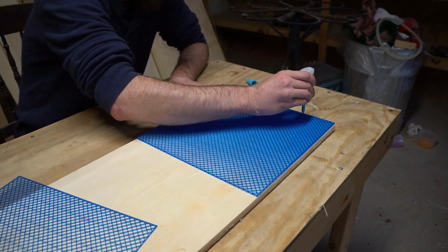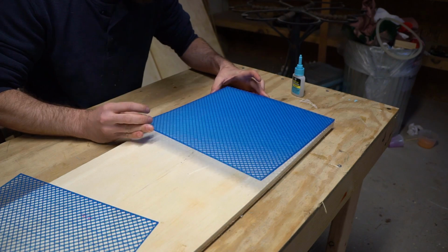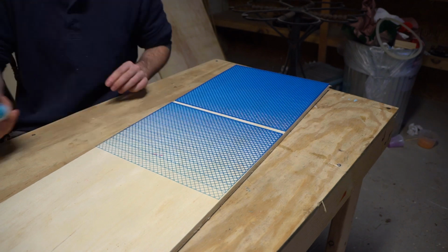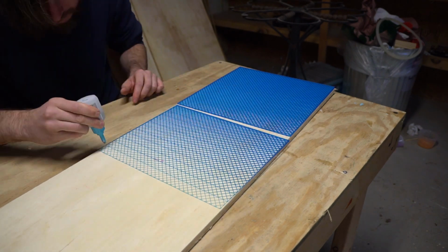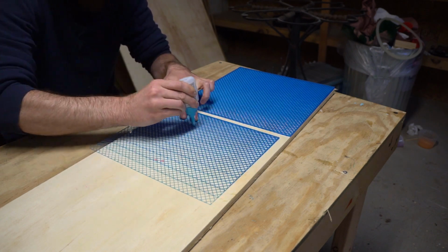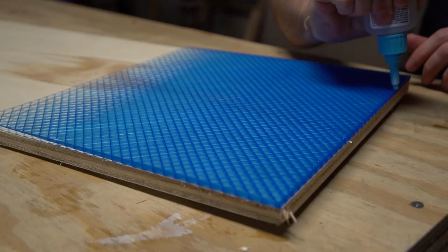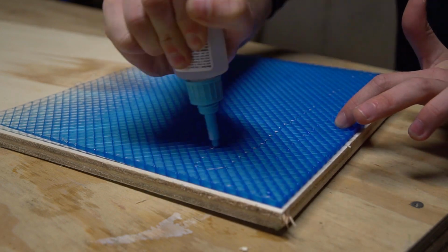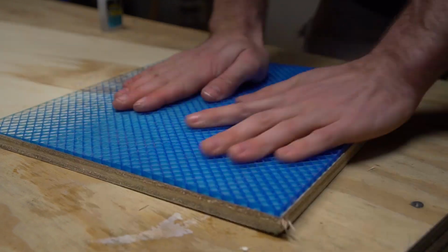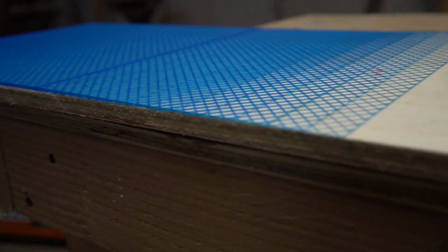I actually made these parts back in the spring, and it's where I got the idea for the 3D printed skateboard mold, but I just haven't put them into use until now. Now that I know that that mold works, these parts are definitely going to work for what we need. All I had to do was attach them to a backing board in an orientation that put the tapers where I wanted them in my core. Once those parts were in place, I had a core profiling cradle with really precise shapes.